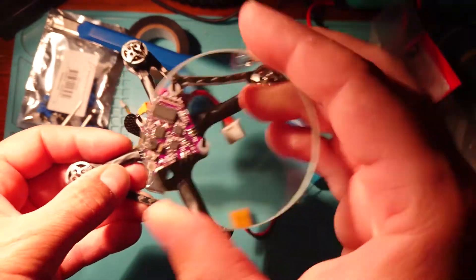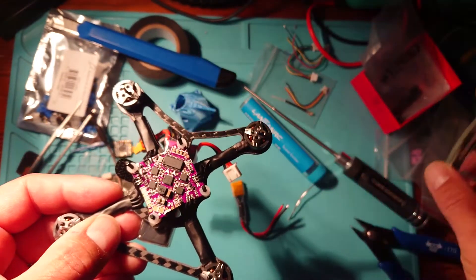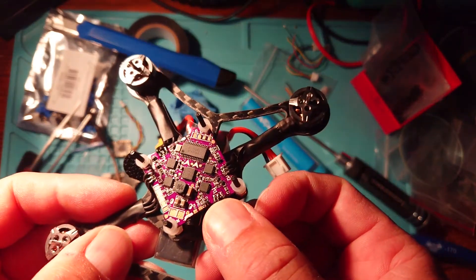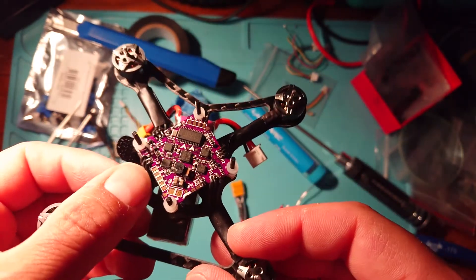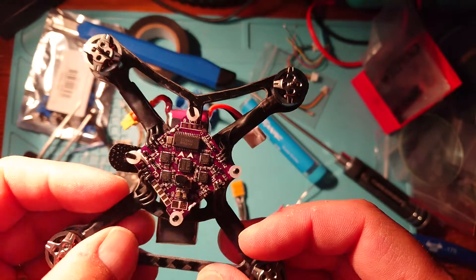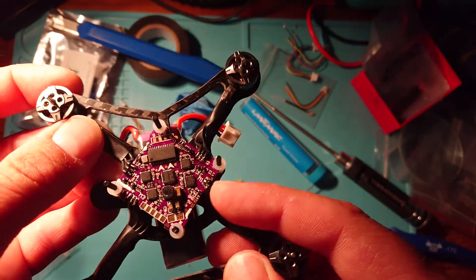We used a little magnifying lens just to check — it's really useful to get one so you can see on these small soldering pads whether anything has been bridged. We haven't bridged anything; everything is individually soldered on nicely with no problems.